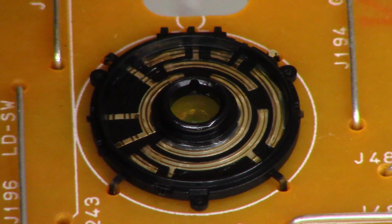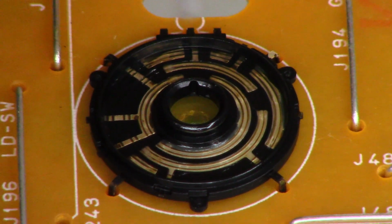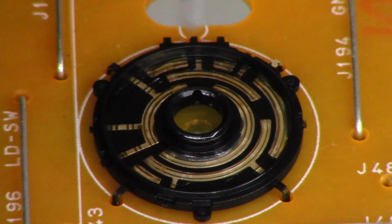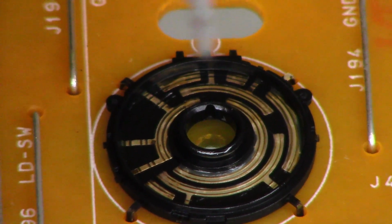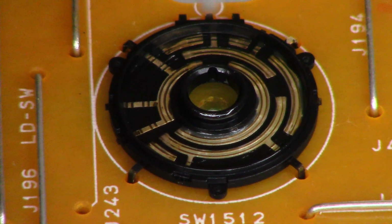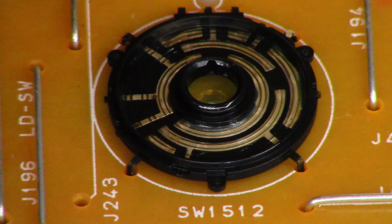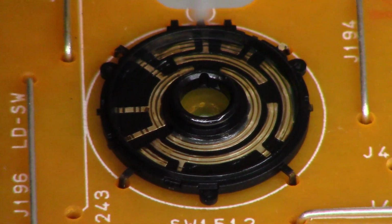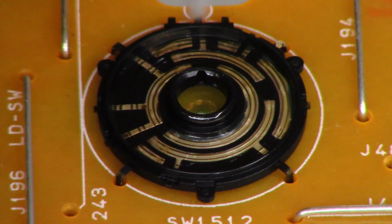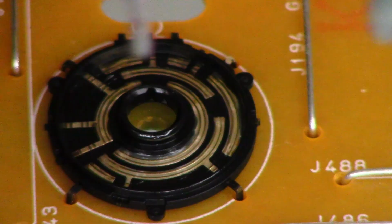We'll go ahead and hit it with the stainless toothbrush. Now, a customer said they only had a brass toothbrush. That's perfectly acceptable. Anything that's going to just basically scuff up those silver plated contacts to make good contact once again. So whatever you have, even a fiberglass eraser would work perfectly fine. Whatever you have at your disposal, I just happen to have a stainless toothbrush, so that is what I use.